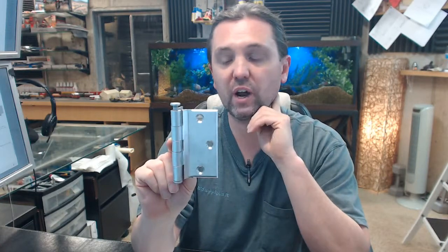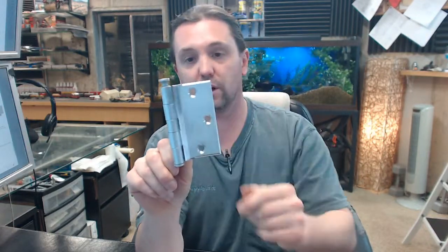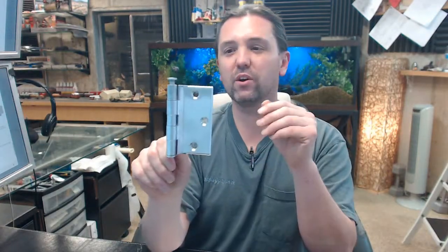You are going to use this sort of hinge when you need to continue to get useful service out of something. I don't know of applications where people say give me half surface hinges on a brand new door and frame. Generally you have got a hinge plate that has failed in the door. Common applications: my clients that buy these are contractors who work for large hotel chains. They have facilities that have 1 3/8 inch hollow metal doors and 4 inch hinge pockets, and they go with a half surface hinge because it allows them to order a new metal door but keep that frame in place that was bricked in decades ago. Tearing that out is a big deal whereas getting half surface hinges is not. They are unsightly but where you are going to see these are in loading docks and applications like that.